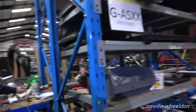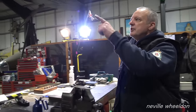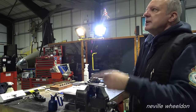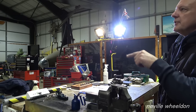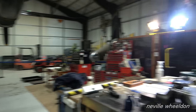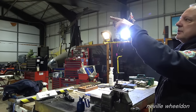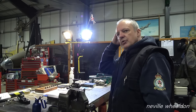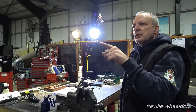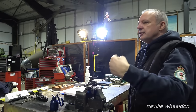Sure, we've got no leaks there. I'm not sure how many pumps we're going to have to give it, because we're drawing the fuel in from the starboard side. Yeah, so you've got a good travel to number one. Good travel, yeah. But the way I've worked it is hopefully that the pipe that comes out of the tank will have the weight of the fuel in it, which will then naturally come out anyway, so it will fill the lines up. And then originally I thought the way I'd routed it, it would have been difficult for the fuel to stay in the pipe to go to the port side. So I've redone it so that when the pipe comes out this side, it's actually horizontal.